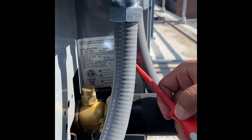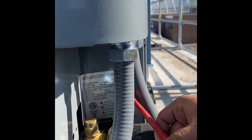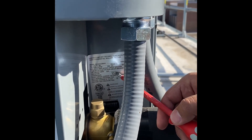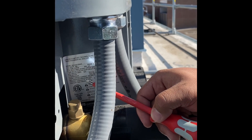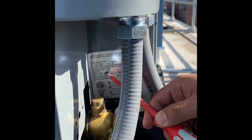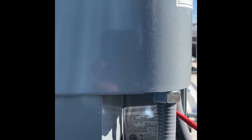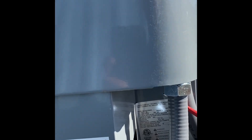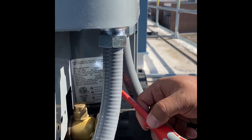So there are two things we need to check: one, the fuses on this disconnect are 35 amps; two, check the circuit breaker to make sure it's accommodating that number. The minimum circuit amps this thing needs is 22 — meaning the wire size has to be at least a number 12 if it's close, number 10 if it's far. Given where the panel is, these should be a minimum of number 10, but if it's number 8, that's even better.